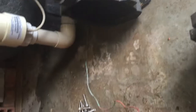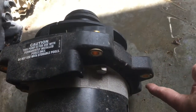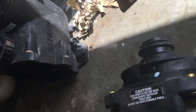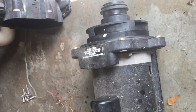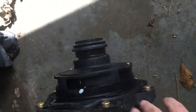You start with taking the six plate bolts — basically the mounting plate bolts. They're right here, three on each side. Then basically you'll pull that section — this is the back section of the pump, which has the motor and diffuser and impeller and all that stuff.